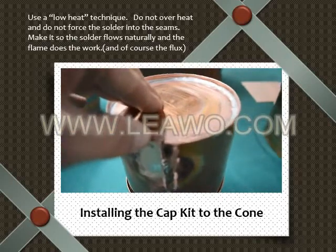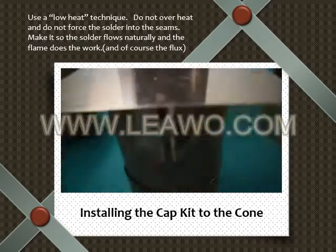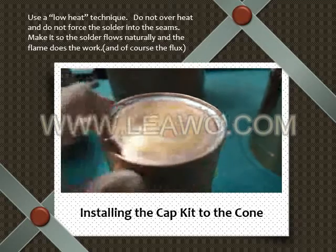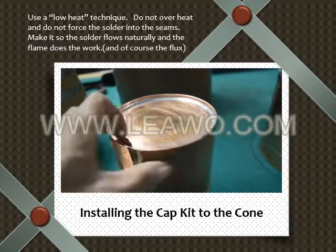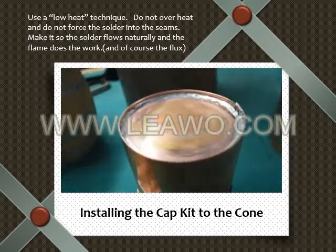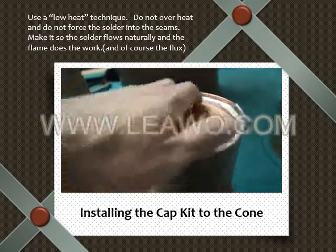This is why we say it's hard. You can just take the piece provided, cut around, make it look somewhat nice, and then solder it, flip it over and solder it. But the way that we do it looks a lot better. And the way you can hold this piece up is by putting something else in there to hold it up. Slam it down, it will hold it up, push it up against the fold, against the seam. You'll have a nice contact point to solder.